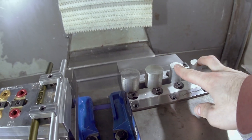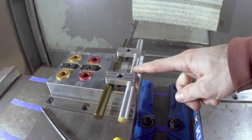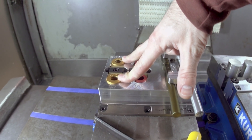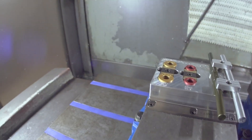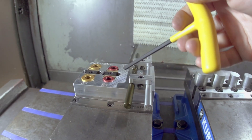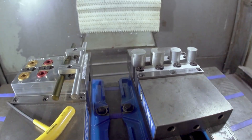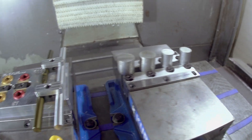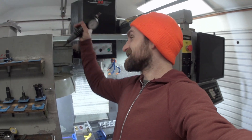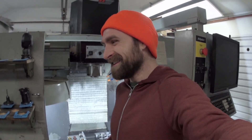When we're rocking and rolling, we've got two Op 1 15 millimeter collars, two Op 1 20 millimeter collars, one Op 1 12 millimeter rod, one Op 2 12 millimeter rod, two Op 2 15 millimeter collars, and two Op 2 20 millimeter collars. This kicks ass. One more detail — same fastener size for both fixture types, so I can use the same T-handle to unload the whole Op 2 fixture. The Op 1 fixture gets undone by just the vice. Easy in and out for all parts. The fact that I can drop these fixtures in and not have to reset my XYZ zero locations is huge, and I'm getting one kit's worth of parts every machining cycle.